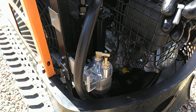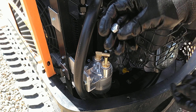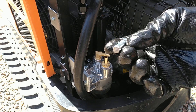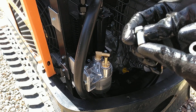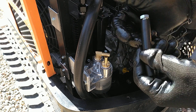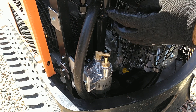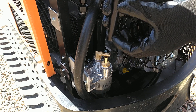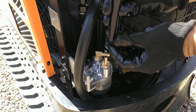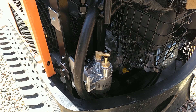To make the air pocket required for the pneumatic oil pump: take a lag bolt from any hardware store, cut it off where the threads begin, sand it flat, and shove it into a short piece of hose that will be the air pocket. Put a hose clamp on it, and it must be oriented vertically — otherwise it'll fill with oil. This creates an air pocket that compresses, since air compresses and oil won't, giving you a little reservoir that cycles oil up and down through.